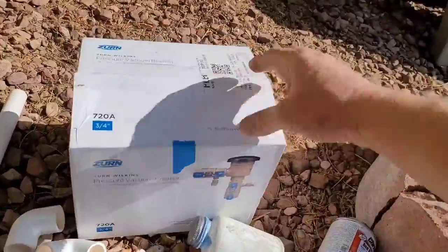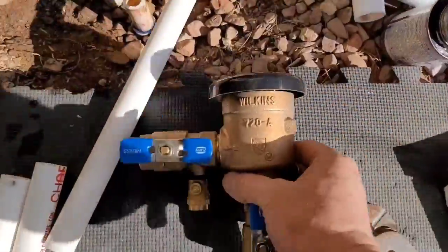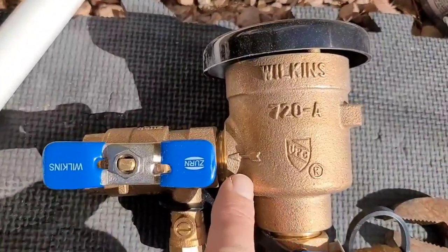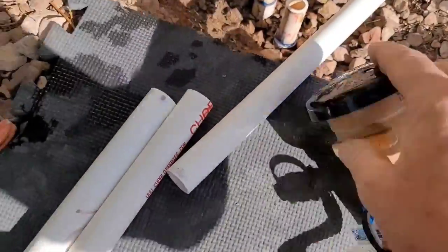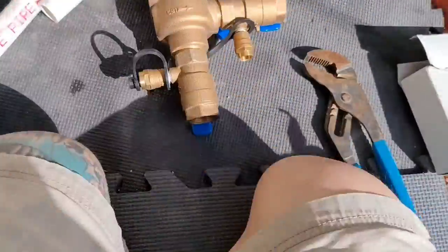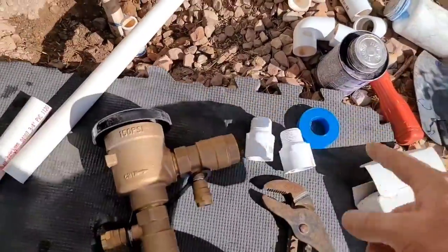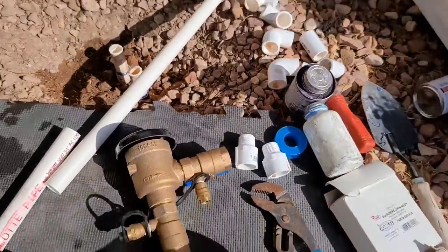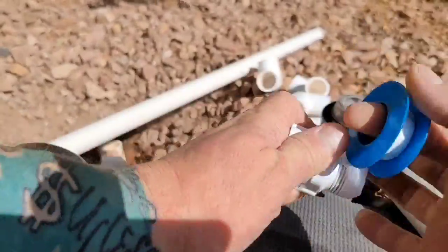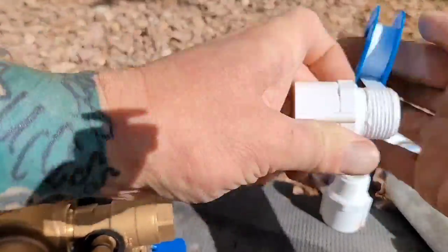All right, this is the new valve. And, you know, plumbers can charge anywhere from, like, shoot, $200 to $700. There was a time where they were bursting in Las Vegas during a cold front, a really cold winter. They always burst. The little diaphragm at the top, that black cap, they burst when it's freezing temperatures. And you can repair just the diaphragm, but typically a plumber will try to get you for the whole valve. Well, I shouldn't say that. Honest ones would just change the diaphragm, but they still cost a lot of money.